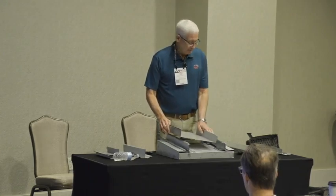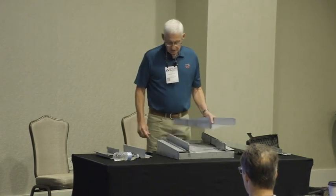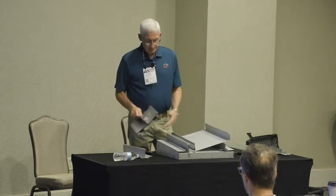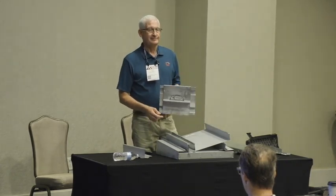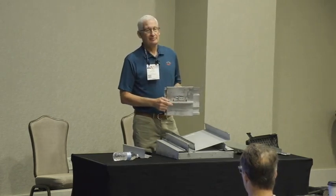And then you don't have to worry about these 2-inch double lock panels. You've got a 2-piece clip. That's how much movement you've got on that panel. So maybe that's good for a 200-foot panel if you fix it in the middle. But if you don't install all your clips exactly perfect, you're going to have some clips installed like that, some clips installed like that on the same panel. Guess what? Your panel doesn't move.